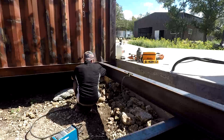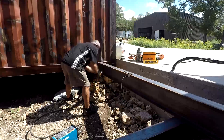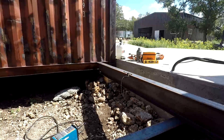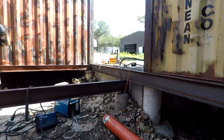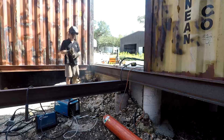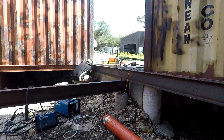I'm cutting a little notch in the bottom of the beam with the plasma cutter. You can see the C-channel of the container is almost level with the top of the beam, and it goes right against the concrete — that's the main header for the living room walls on that side. I've got the argon CO2 tank and I'm MIG welding everything. I've gotten pretty good at stick welding, but for horizontal welds I still can't get it 100%, so I'm using MIG wire and it's going really smooth and easy.